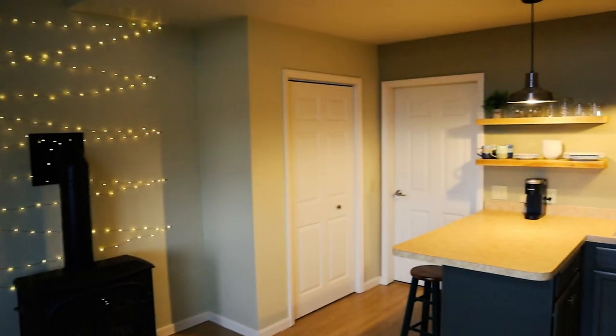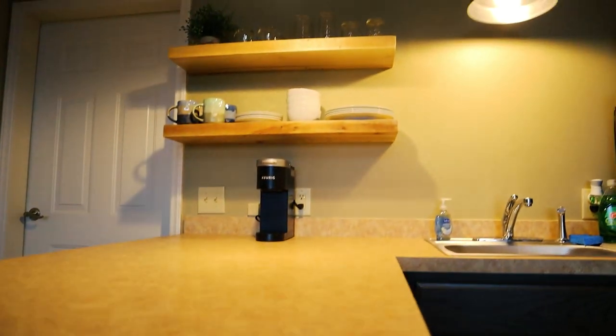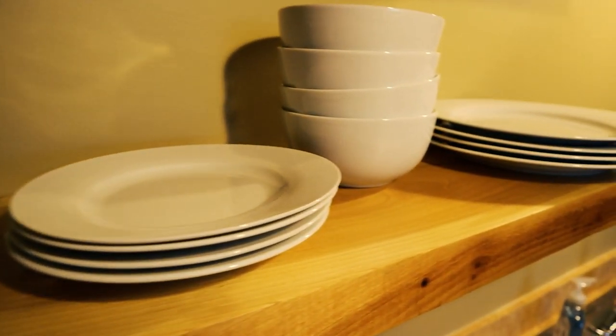Today I'm going to show you the real way to install floating shelves, not the wobbly way you've seen in other videos. The biggest problem with floating shelves is that they start to wobble after a short period of time, and the reason is because you install the brackets on the outside of sheetrock. Sheetrock is soft, so after a while and a little bit of movement, you'll start to have a softening spot and they'll continue to wobble. In this video I'm going to show you the right way to install these brackets. The pictures on the Amazon brackets I bought show you installing them on top of the sheetrock, and that's just not what we're going to do.